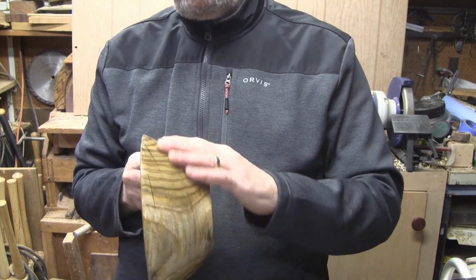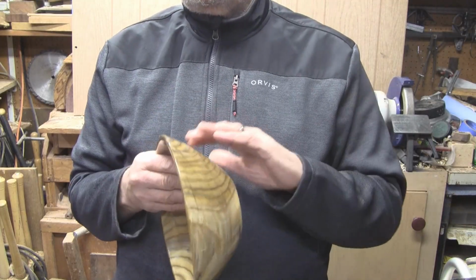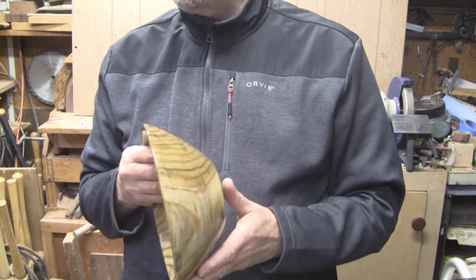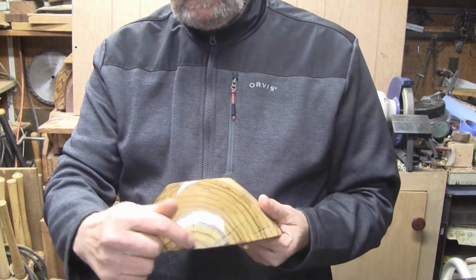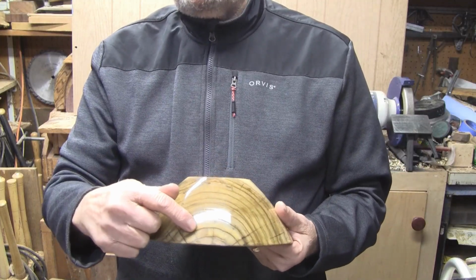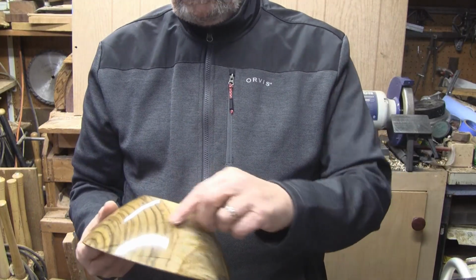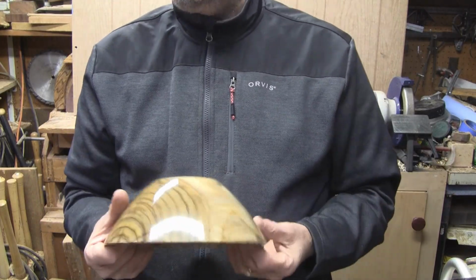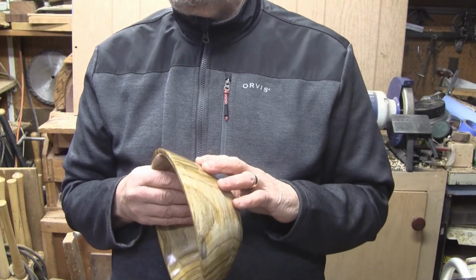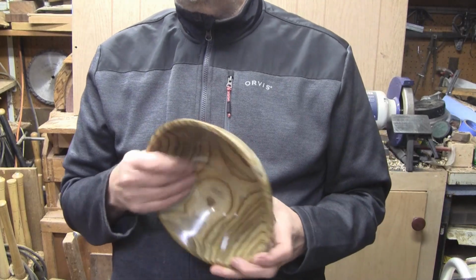sometimes the grain, you can feel the growth rings on sumac, and what I'll do is just use a coat of sanding sealer, which is common to do, sand it again, and it sort of disappears. Well, because I had these big cracks which went pretty much all the way through, I used CA on them. The cracks also radiated down into here, and there were just some on their own, and I thought, well, I've done this before. I'll use 320 grit and the sanding sealer. It makes a little slurry. It goes down in there and it actually does a nice job.